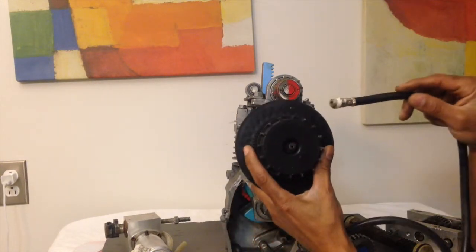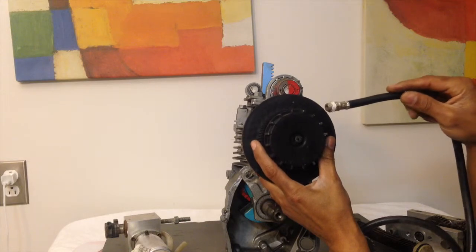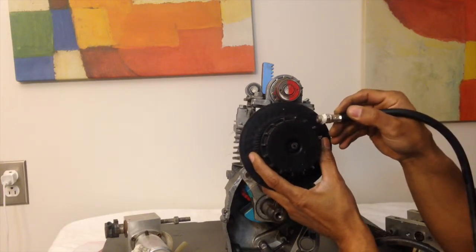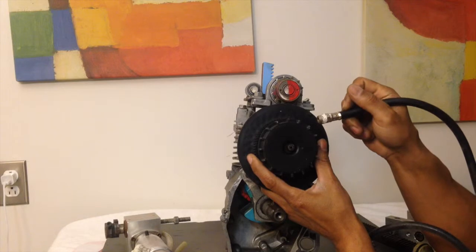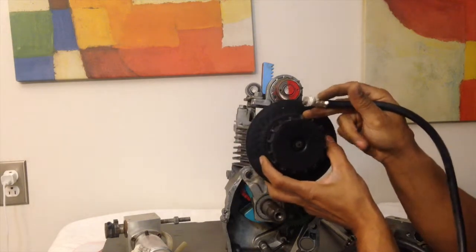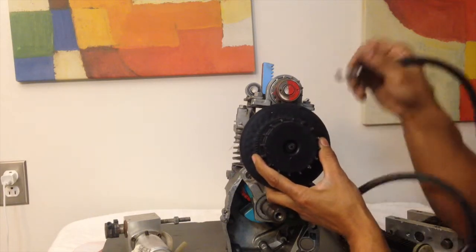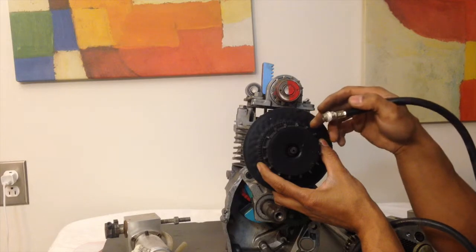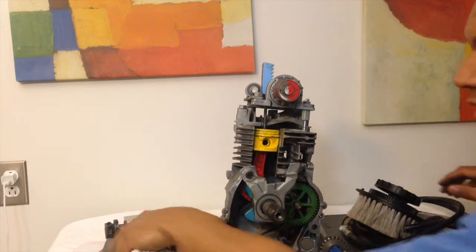When I was talking about water jet pressure, imagine this is the water jetting with the water to the system. It uses the pressure to convert the water into a jet, so it's not really the static pressure hitting over here — it's going to be the water speed that the pressure inside sends. When that water speed hits over here, you're not using static pressure. If you stop the turbine, it's just going to splash water everywhere. The water pressure inside sends water with speed, and that speed is what rotates the turbine.